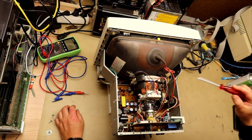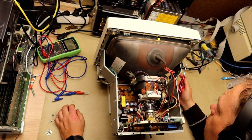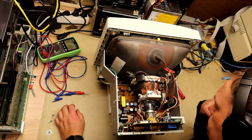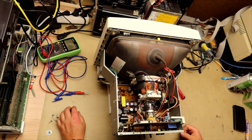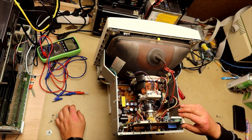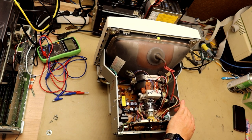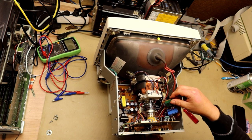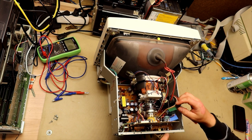This is a Philips monitor, as we stated earlier, so at least that's right regarding the specs. But we can see no obvious faults in here, and since the monitor does not light up, we do suspect that there is a power issue, but it can also be some issues with line drivers and other stuff that has so much strain on the power supply that it won't start. I think this is a line delay driver. I'm not sure, I have never seen this kind in a computer monitor before, and it's on an extra card. I'm not sure why it's there.